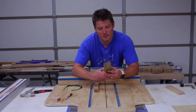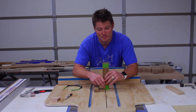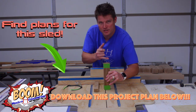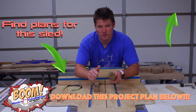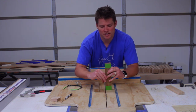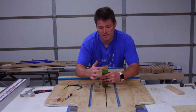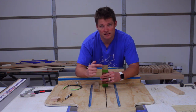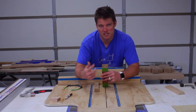I'm first going to start with the turret — it basically is going to be the foundation for all these cuts. I'm going to cut out a three-quarter inch groove this way and a three-quarter inch groove that way using one single blade, and I'm going to implement my half-lap method that I've done on prior videos to get this thing nice and centered. Being that this is a two-inch square, taking out the three-quarter inch groove leaves me with five-eighths on either side. I'm going to undercut it a little bit so I can sneak up on the measurement.